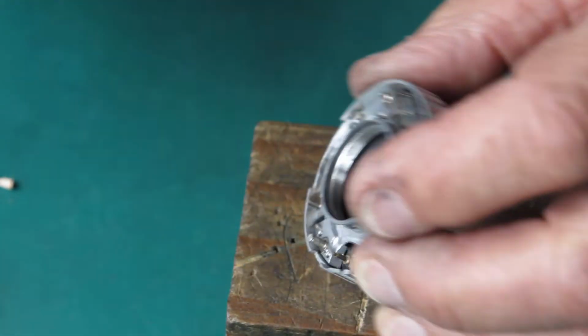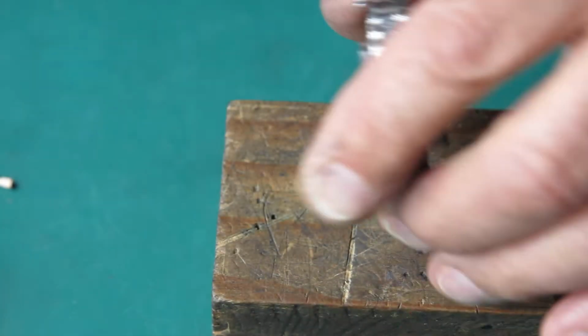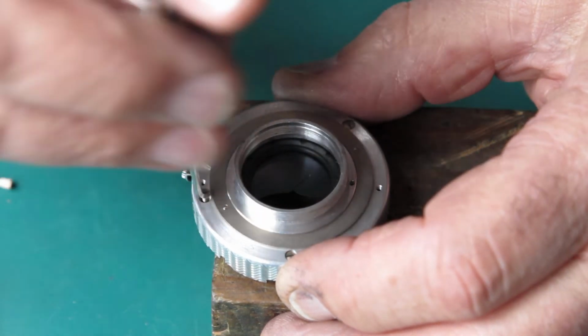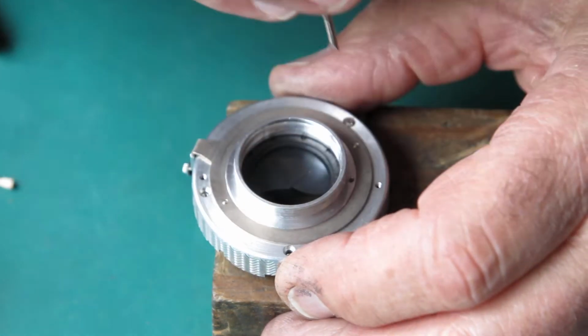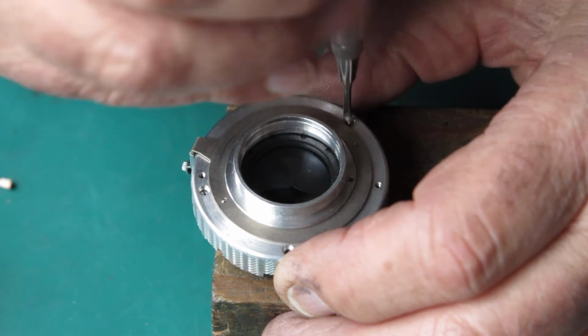That'll do. Just flip this over, flip this lever. Right, see there, the shutter blade here, it didn't move. So one of those blades popped out of position while I was putting the case over. And if I'd tightened those screws up, I would have damaged the blade. Let's just have this case off and put things back where they should be.